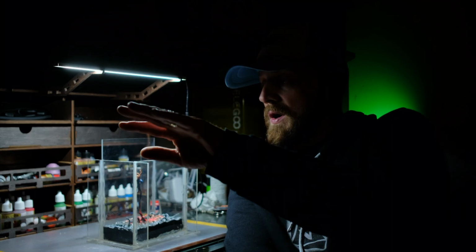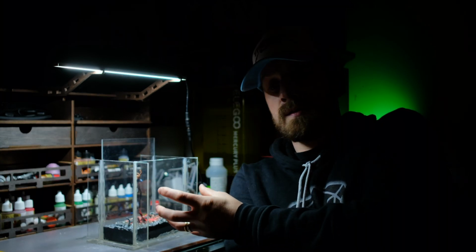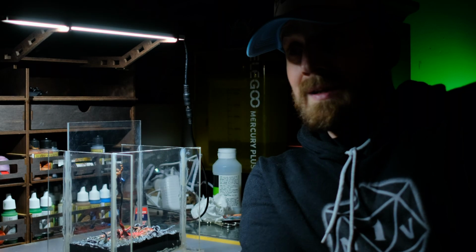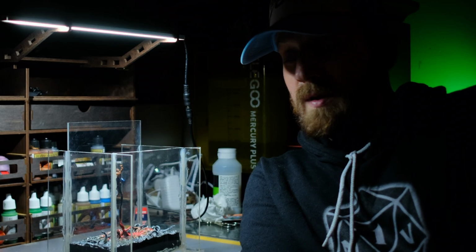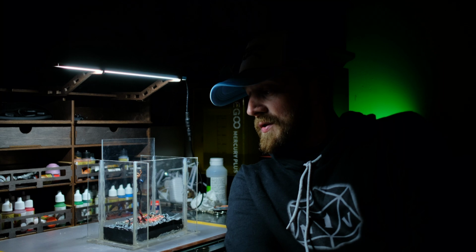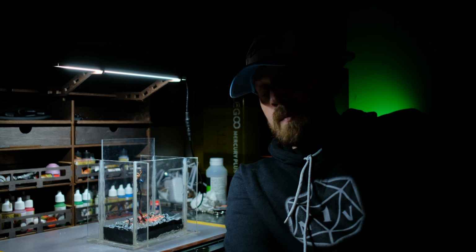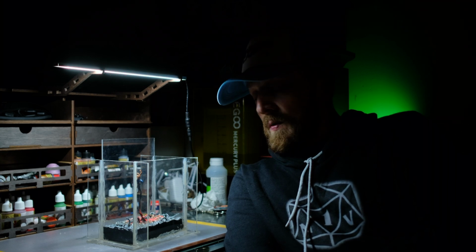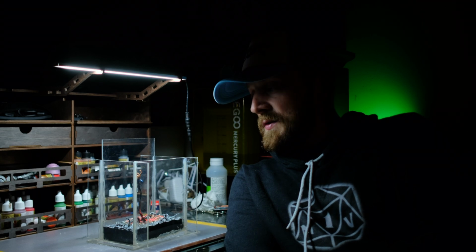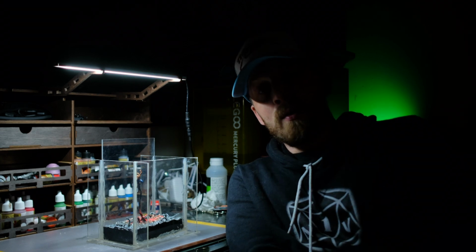So you're constantly moving the warm air away from the top of the project, cool air, and the water bath is going to leach out some of the temperature within the epoxy resin. Now, that's kind of where I'm going with it, because I want to do this in one pour. I'm totally aware that I might destroy this project that I worked really hard on, but I think that I'm going to risk it and I'm going to try and pour the whole thing in one go. I'm going to put it in a water bath and I'm going to blow a fan over the top of it. And hopefully, I am actually praying.